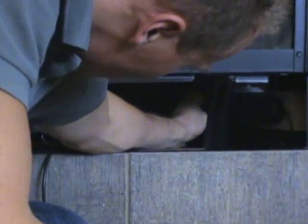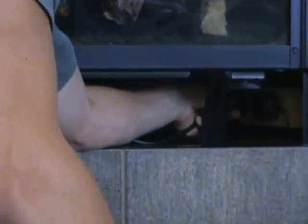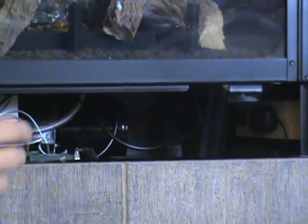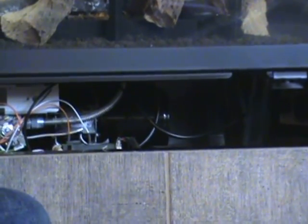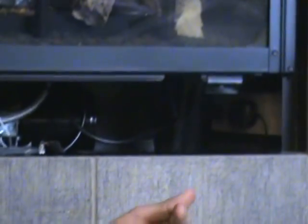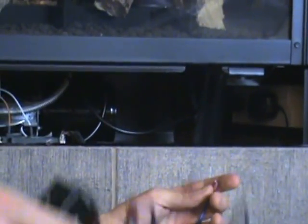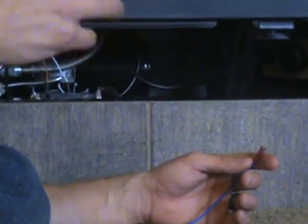Now when you plug that in, you'll notice that the blower doesn't come on — and that's normal, that's a good thing. That means your unit has been installed correctly. Because the fan terminal needs to be activated by two terminals being connected; otherwise it doesn't allow power through. The way we do that is instead of jumping between those two terminals to turn on the fan, we'll actually use the speed control and the thermostat switch to connect those two terminals and interrupt that signal.